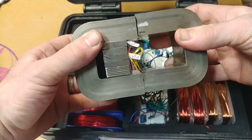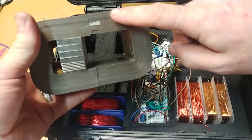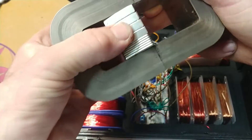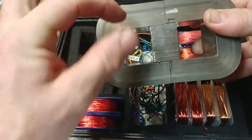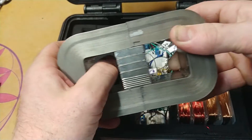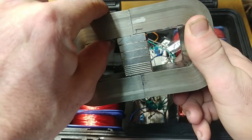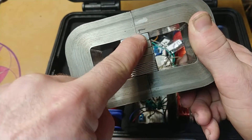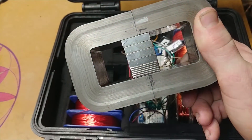Here's the core. The magnets are going to be in the center here. We're going to have an input coil here and another one down here just to take the core to saturation — we might even have one over here as well. The flux is supposed to stay inside this circular path here. There's probably going to be some stray flux over here, so we'll put a coil there to see how much is actually going through that side.